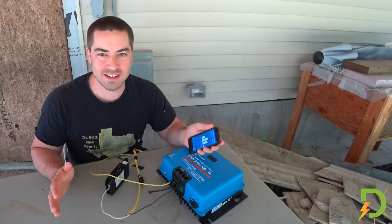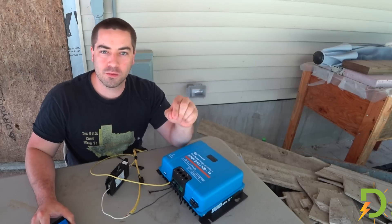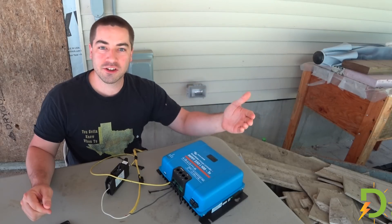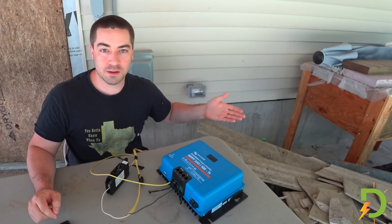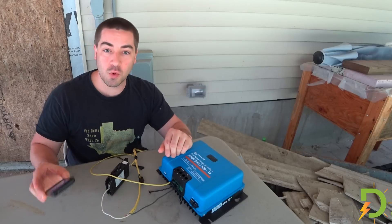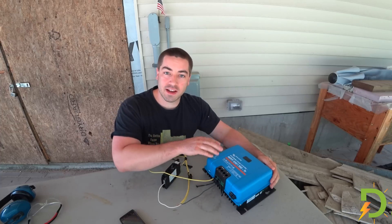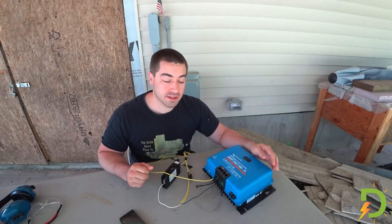That's fantastic for the batteries — we were at 42.7 volts and now we're up at 48 volts. These batteries can actually be fully charged up to 50.4 volts and we weren't 100% depleted either, so there's a big range and we've put 12 kilowatt hours in and can put even more. This charge controller is quiet, it connects very quickly, it does the MPPT. So far I'm very happy with this.